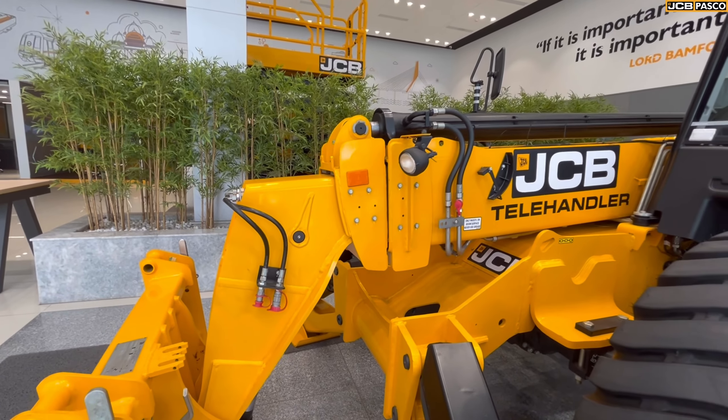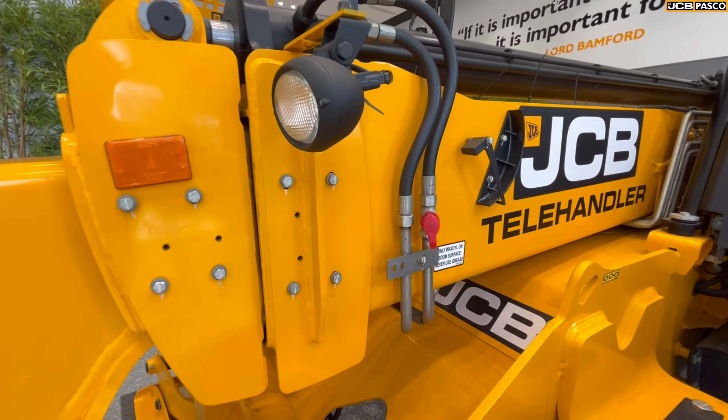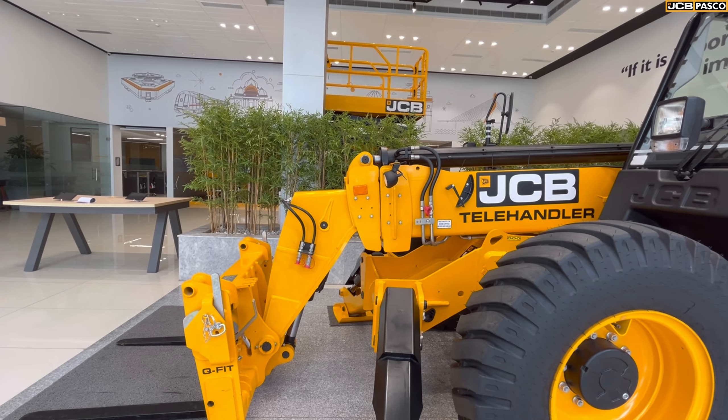There is a spotlight on top. You get heavy-duty hydraulic cylinders and steel braided lines. There is a two-section gear pump which creates a pressure of 245 bar at a capacity of 100 liters per minute. There are two halogen spotlights in front and spotlights in the cabin. The JCB 3DX and Telehandler both use the same engine.